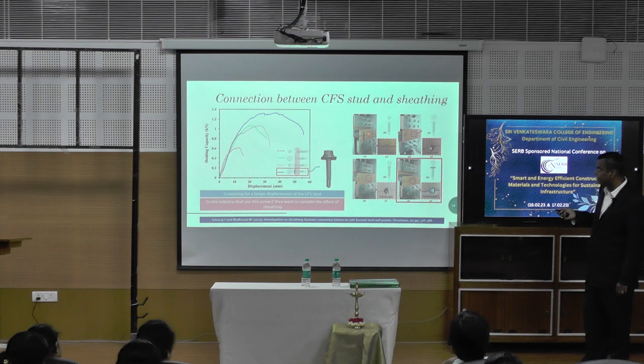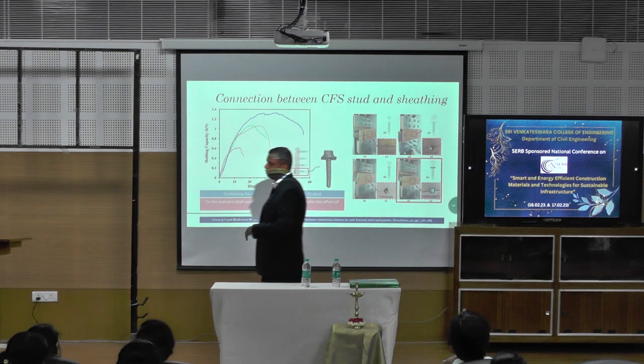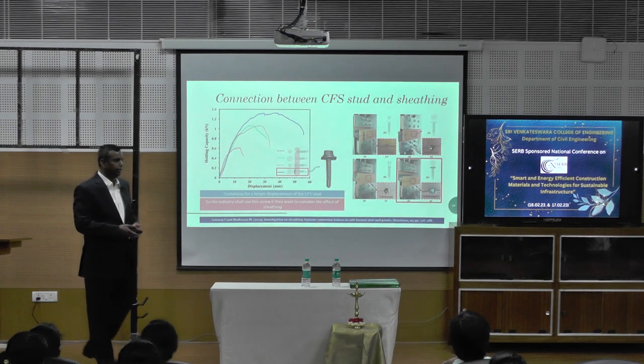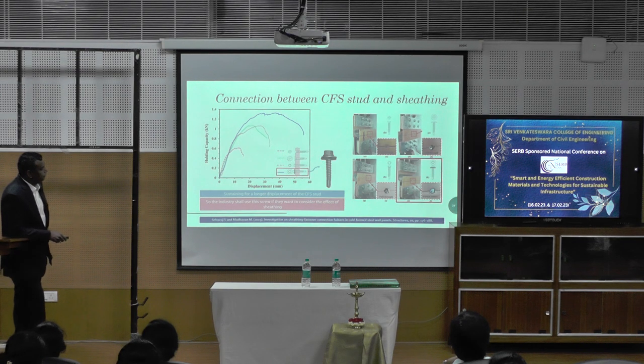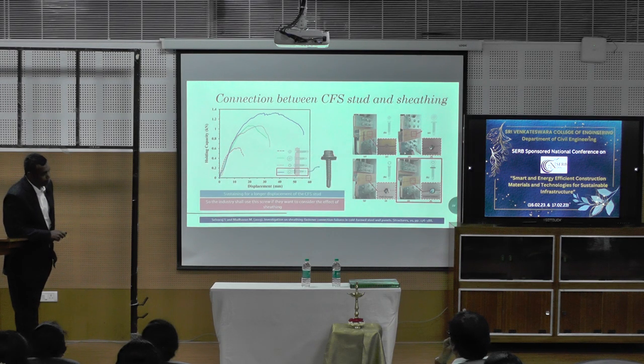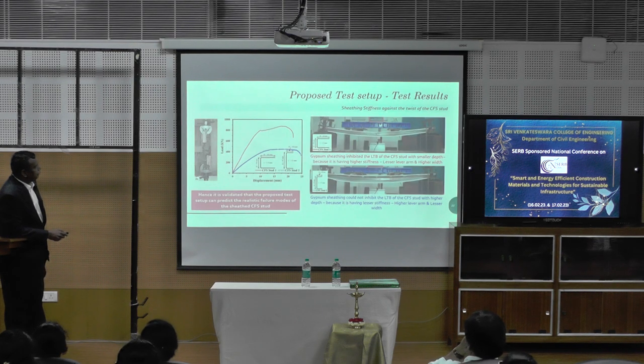So we carried out a lot of tests. These are all coming from sweat and blood, because a lot of students worked on it for several days together, night and day, and then they produced all these test results, which I am using to share my knowledge with all of you. Okay, so the industries use this screw if they want to consider the effect of sheathing. So if you want to consider the effect of sheathing, you need to use a screw that may look ugly, but so be it, as long as it takes the load.